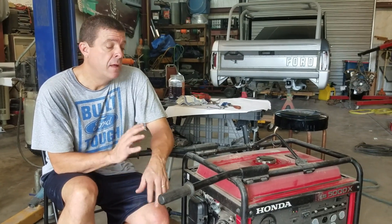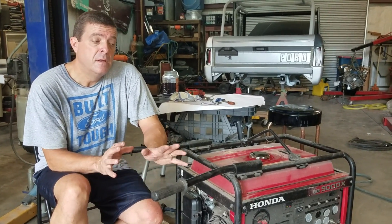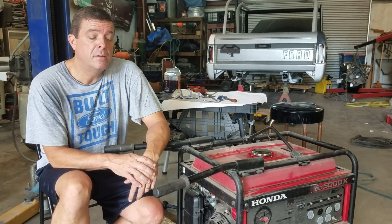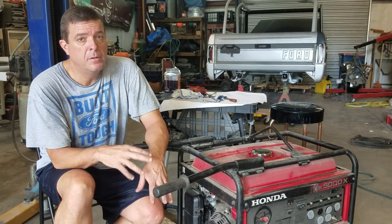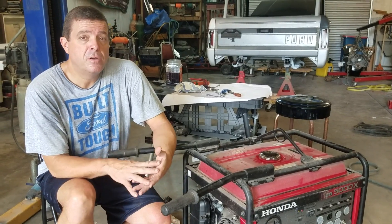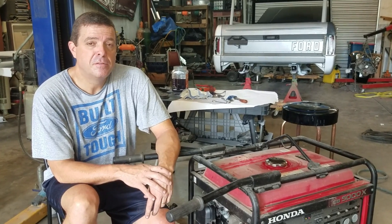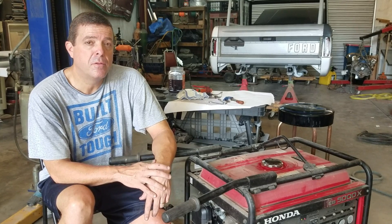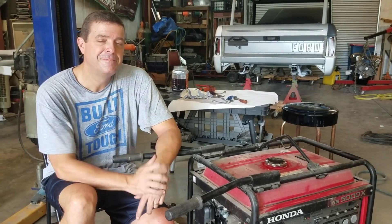Okay guys, thanks for watching. I hope this helps you get your generator going, and I hope you don't have any problems with the storm. This is useful information if you've never done this before, and it works the same way with most carburetors. Just watch the way you take them apart, clean out the bottom, clean out the jet really good, and the fuel needle — those are your really important parts — and make sure you've got fresh fuel. Remember: don't run your generators indoors, run them outside. Have your extension cords handy. Hope you guys stay safe if you're in the path of the storm. We'll be back on the Broncos soon. Thanks again for watching, take care, see you next time.